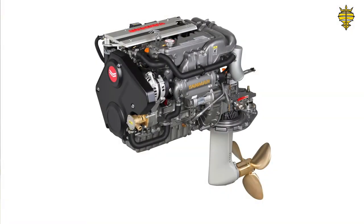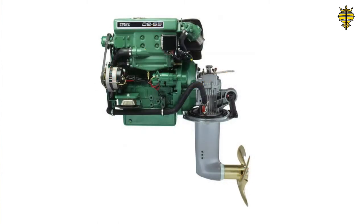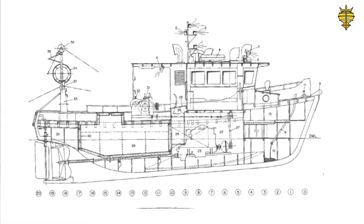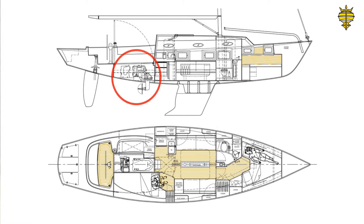Sail drives on sailboats don't tend to yaw, so you can't steer them — they normally have a rudder behind them and are fixed in place. The nice thing about them is it changes where you can lay out the boats. Naval architects are keen on placing weights and keeping the ballast down. If you've got a fixed engine that has to have a 7-degree shaft angle down to a propeller, that pretty much dictates the layout of the boat. With a sail drive, everything is compact and you get a lot more flexibility because you don't have the shaft line to run through.